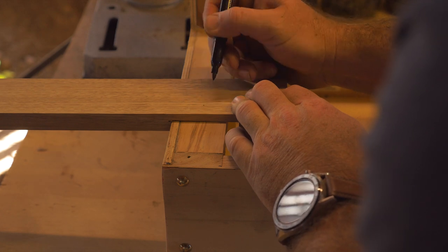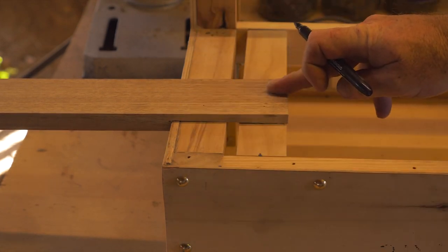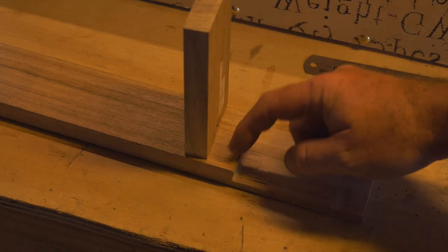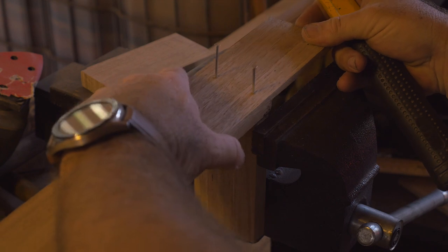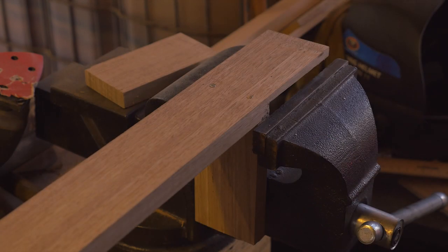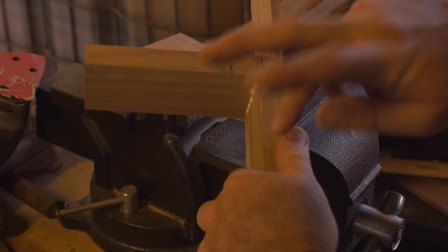I'm using my electric sander because it's quicker. We need to make sure this part is flush — it's going to be turned over and bolted on top of the soundboard, so you won't see underneath it, but you need to make sure it's flush so it sits nicely against the soundboard. Sanding is going to achieve that. You can see it's nicely lined up — we've got the 4 inches there and it's at half the depth, which allows it to drop down a little bit. The reason we do that is because we don't want it to sit too high.